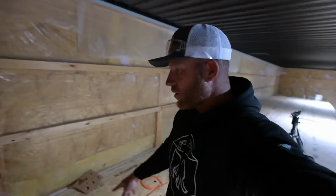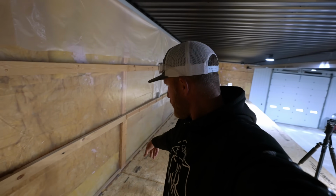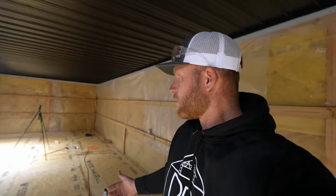All right, that finishes up the staircase opening. I got a little bit of cutting to do, and then we'll go ahead and rip down little tiny pieces, about 2.5 inches. That'll run down this whole back wall. It's just kind of a filler strip. Luckily, it's on a lot of solid material there, so I don't worry about a little piece. I obviously wouldn't want to leave a little piece there if it was not going to be supported. But up against a wall like that, no one's going to be jumping around, walking around there. It's not really a big deal. We'll glue it all down.